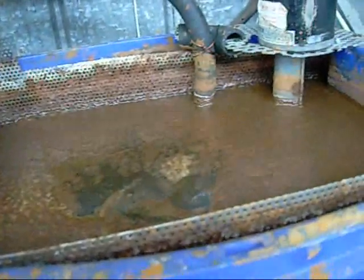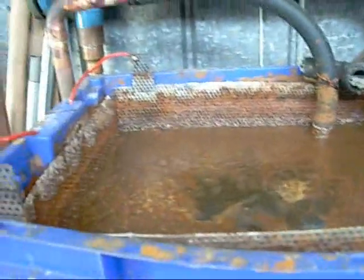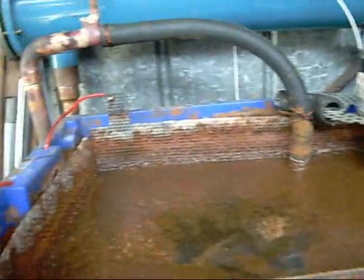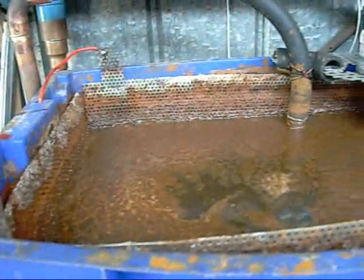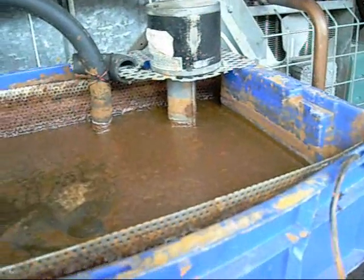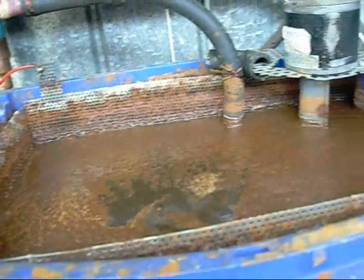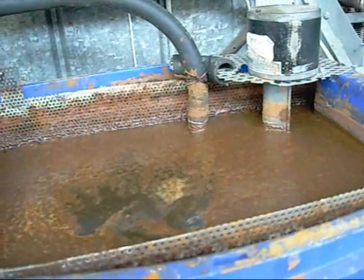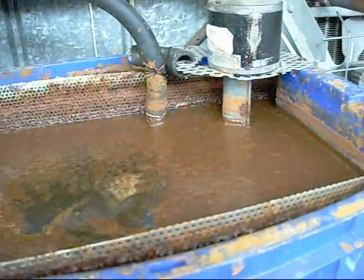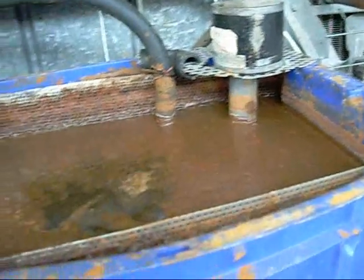The amount of time required to clean a work piece depends on a lot of things, and the first time you try and clean something it will pretty much tell you — it's a lot of trial and error in electrolysis, there's no set formulas or times. I recommend 24 hours for a heavily rusted part with no excessive amounts of grease or paint on them, but if it's got a lot of paint on it, as you saw with the motor cowling, that's been in here about 48 hours. Some parts will not come off, or you have to give it a bit of a scrape and put it back in. But it's up to the user really. I hope you all have fun playing around with it.